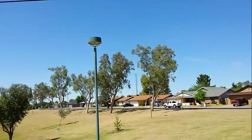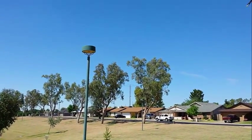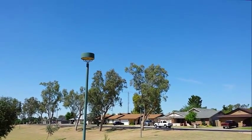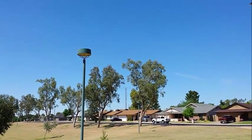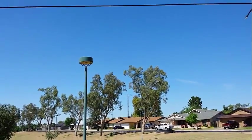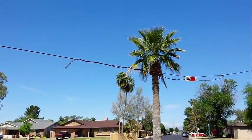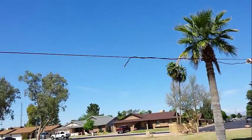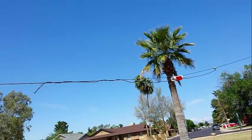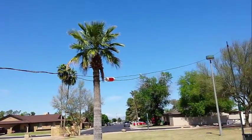Running 100 watts to it. You can see the tower in the background — that's my home station with a 75-meter full-length dipole and 40-meter full-length dipole fan antenna on a crossboom. Talking with a friend up in Cave Creek with KC7MMI on this portable station versus my home station, 100 watts into each antenna — signals were identical on both 40 and 75 meters.